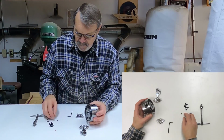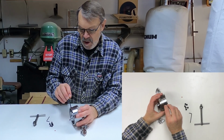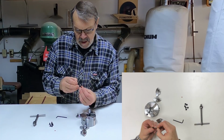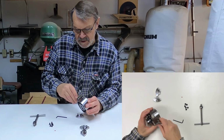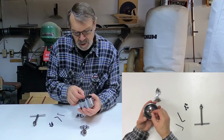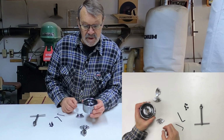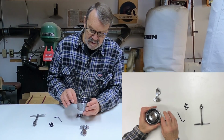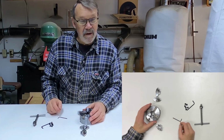Now, also included is a small grub screw. And I don't know if this is going to show up on that camera above me, but there's a spot right there for that grub screw to go in. And the purpose of that is to tighten it against your spindle threads so that this won't spin, especially if you put it into reverse. This could come off. Now, so as not to damage those threads, there's a little fiber dot here, I don't know what else to call it, that you set in there, and then the grub screw will push that against the threads of the spindle instead of metal to metal, which could damage them. All right, I'm going to put the rest of the jaws on the slides, and then I'll meet you over at the lathe.